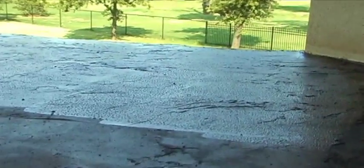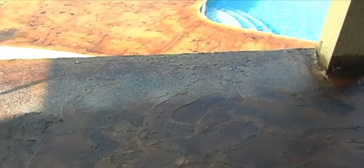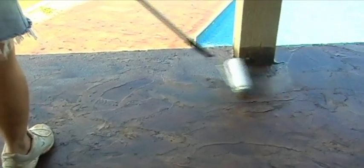DCI sprayable satin finish sealer is by far our most popular sealer and can be used for both indoor and outdoor applications. However, we recommend applying a water-based sealer in occupied homes or offices and in basements. Always use caution in applying solvent-based sealers, especially during indoor applications. Wear a mask while applying the sealer and make certain the room is well ventilated to the outside.